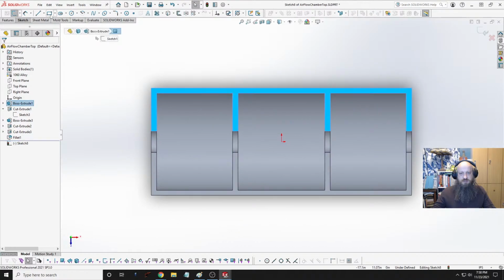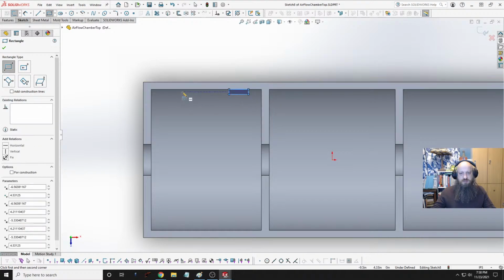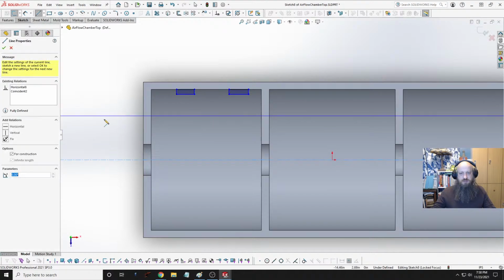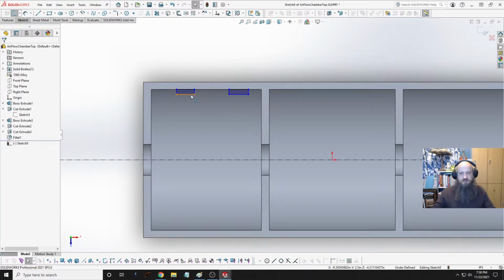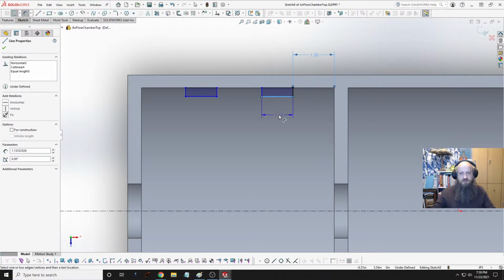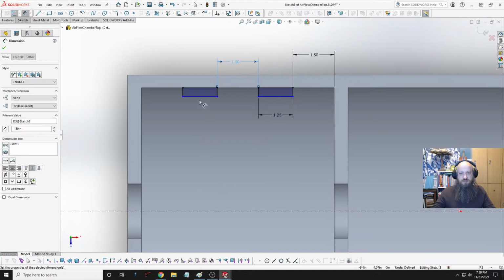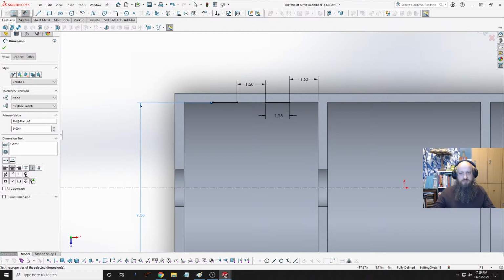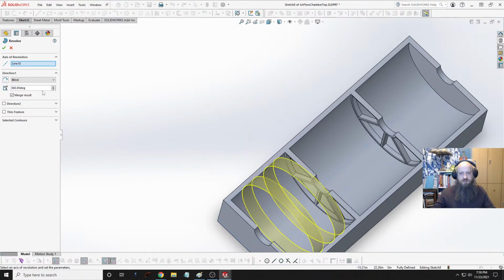Do a new sketch there. Oops. Center line, infinite length, horizontal. Boom. Whoops. I want this and this collinear. I want this and this to also be equal. And throw the dimensions in. 5, 2.5, 5, here to here, and 9-inch diameter. 12. Let's see, 1/2 of that, and it to be the other half. Boom.